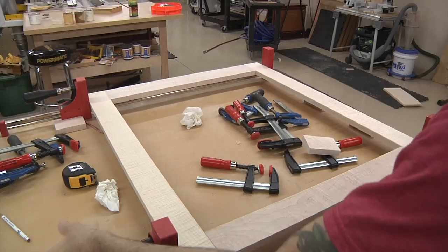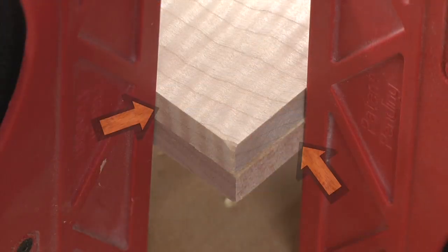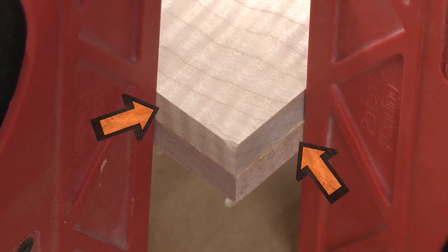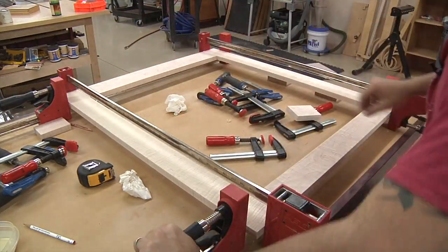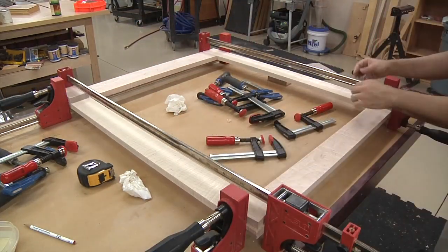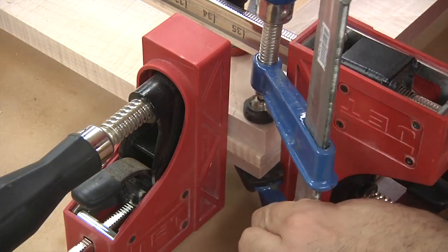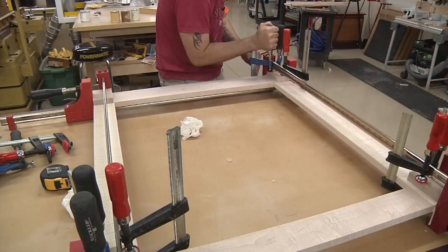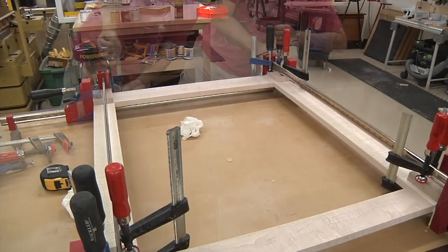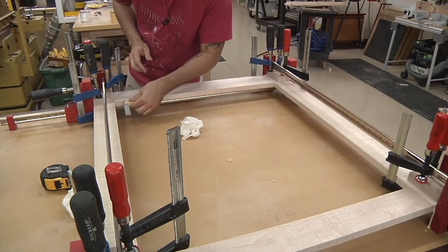I'll add a little bit of pressure and then bring in the second set of clamps. You can see that the sixteenth-of-an-inch overage ensures a nice, tight shoulder. I'll loosen and retighten all the clamps just to make sure everything is hitting home. At each corner I'll drop in a caul and add the small clamps. You might think the joint is tight, but watch what happens when we apply pressure — that squeeze-out tells us we're making good contact. Check for square, as always, but if your half-lap shoulders are nice and square, there really shouldn't be much to worry about.